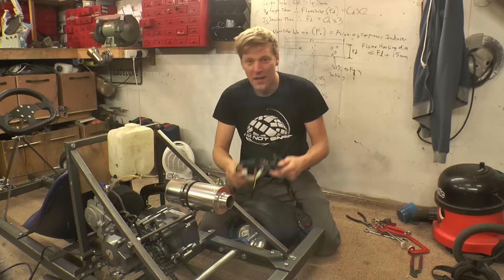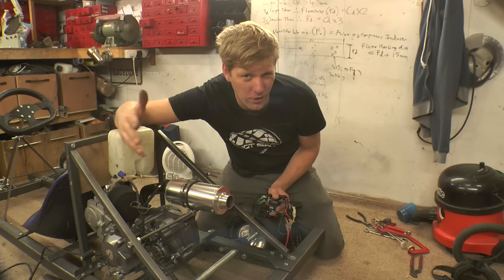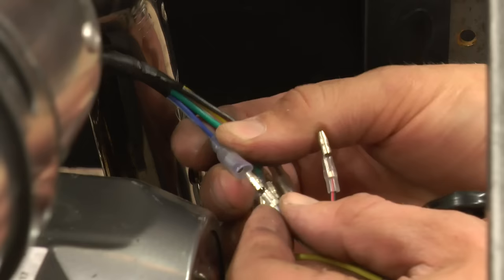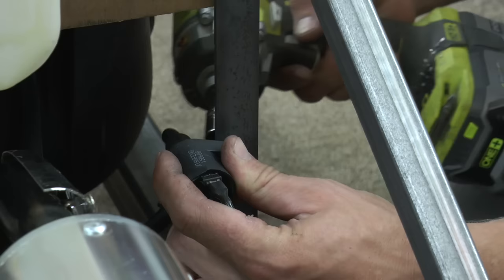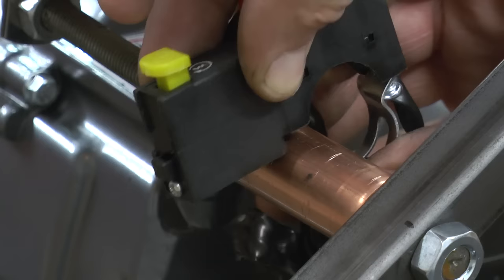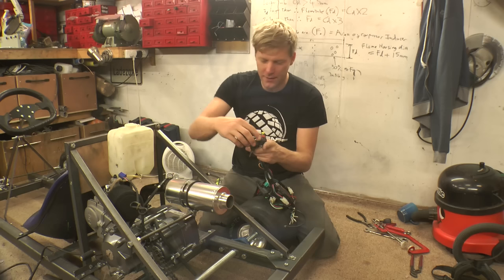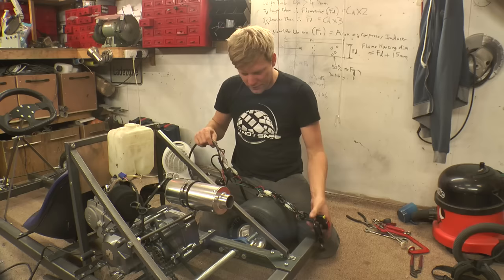The electrics look more complicated than they actually are. You've just got five wires which stick out of the engine from behind the stator cap. There's another wire that pops out behind the sprocket — that's for gear lights telling you what gear you're in — but we don't need to worry about that, so just cut it off. You basically just connect the five wires up; they're all colour coded so you can't get them wrong. The stator, regulator, and CDI unit just bolt or zip-tie up around the frame, and the starter switch goes on my little piece of copper on the handlebars. The ignition key we can just cable-tie to the side of the frame.